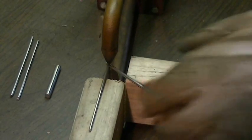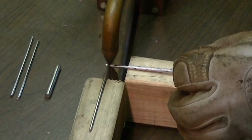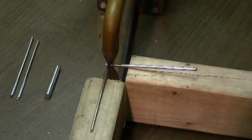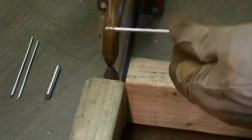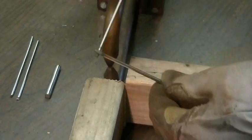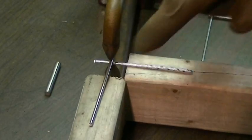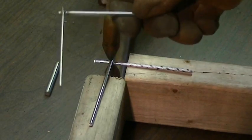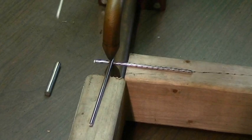I'm going to apply a little pressure and trigger the spot welder, letting it get really nice and warm. That's actually holding quite well. Here is our second test — both of these this time are a full 1/8 inch in diameter. The 1/8 inch and 3/32 combined is just about a millimeter more than what this spot welder is rated for, and it seems to be holding pretty well.